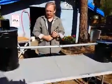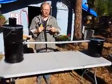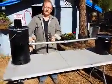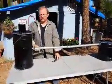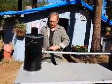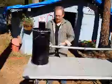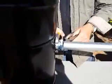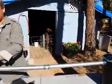For tightening these things, 2 wrenches are required. If you single wrench these things, what you're going to be doing is putting a lot of torque against a sheet metal side, and that's going to cut down the life. So there's a shoulder on here that you can grab with one of your wrenches, and then you loosen or tighten with the second wrench. So you're securing the gasifier, and then on the cooler side, you tighten it down snugly. And you don't have to go nuts with this. It's not a high pressure system, so you don't have to wrench it to death. Just get it reasonably snug.